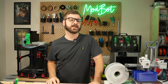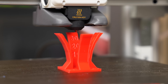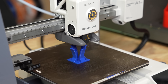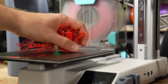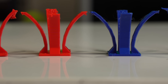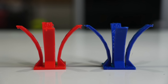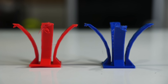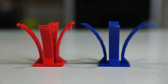Next was the overhang test. I found a model with four overhangs facing different directions, starting at 0 degrees and extending to 80. I ran this test twice with both filaments because in all cases the print failed before it could complete — once a certain height was reached, the filament just wasn't depositing well, which ultimately led to the part being knocked off the build plate. One of the high-flow prints got the farthest, reaching halfway through 60 degrees before failing. Using the high-flow test that failed at 50 degrees — where both basic prints also failed — I would still say high-flow wins. Up to the failure point, high-flow is more consistent and laying down cleaner overhangs.